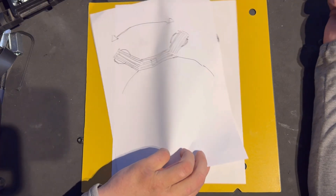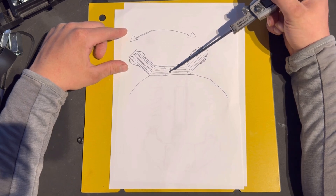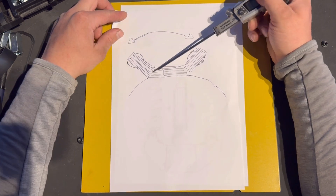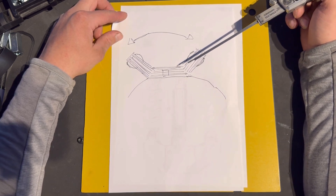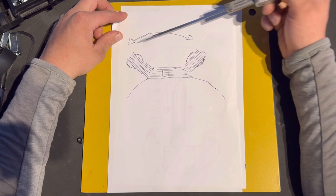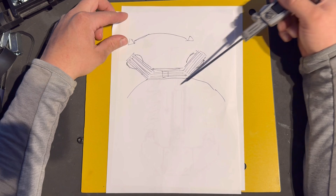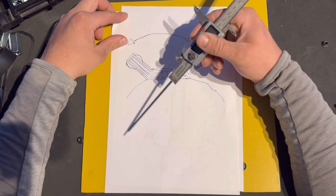In a top-down view, because it's mounted in two tubes that fit into each other, they allow rotation of the body left and right — you can imagine the springs flexing as your body turns around the shaft. The bracket is made out of many pieces of machined aluminium that when stacked and bent give you an offset from the center shaft. That offset is important so the springs can act on the weight of the suit from all angles and axes.